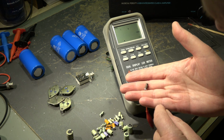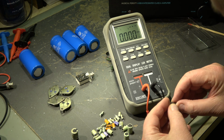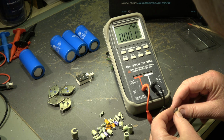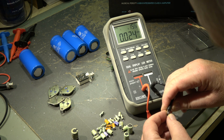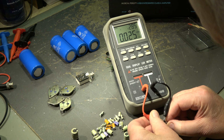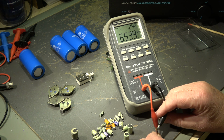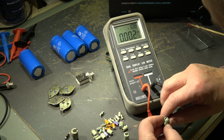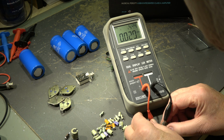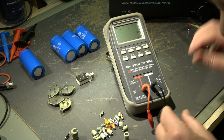And now I measure this totally decolorized one. Might be, by the way, the tube is shrunk. Here we have a capacitor that should have, what is it? Is it 10 microfarad? Yes, I think 10 microfarad. Should have 10 and has 6.5. It's heavily roasted. This one should have 470. Oh, 480, that's okay. Yeah, good one.